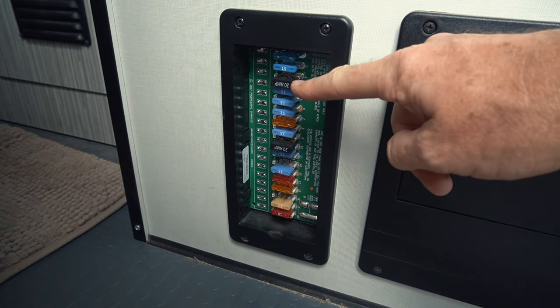While I was messing with the cables here to figure out how to install my new switch, I created a little shortcut and blew a fuse — but not the main one down in the panel. There's a hidden fuse just for this tiny little panel here that sits behind the big one, and you can only get to it by removing the big panel. Not sure why Winnebago thought it was a good idea to hide a fuse in there — it's not really documented. But if your bed doesn't work, it might be this hidden fuse.